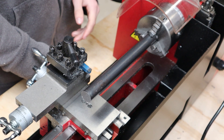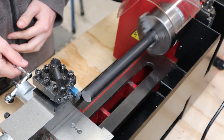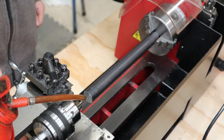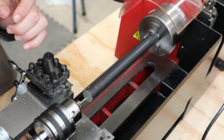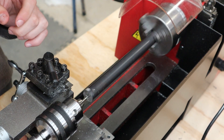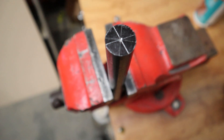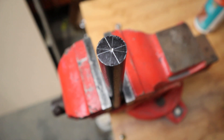I think the teacher would cry if they saw this. The next step is to drill a small hole for the live centre to support it. I loaded a pilot drill into the chuck and gave it a go — that still didn't work. So I switched gears and thought I may have needed a steady rest to help, but I couldn't wait for that. So I found the centre of the stock myself and drilled the hole in.